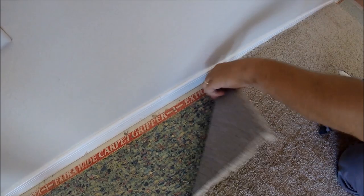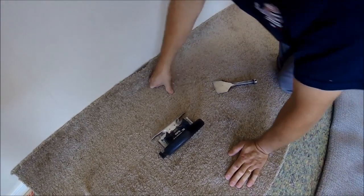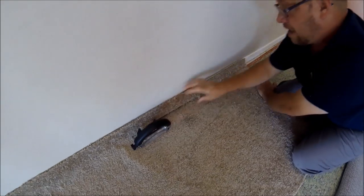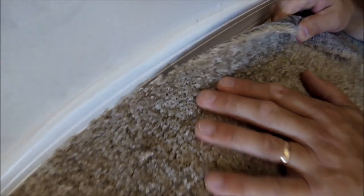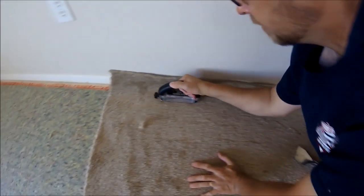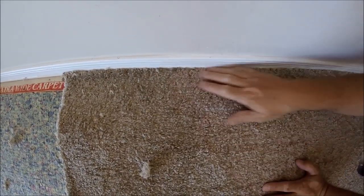So I'm going to pull this up now and lean it the other way. I'm going to cut this without mashing it in the corner, just to show you that it will cut short. I didn't mash it in there or anything — see that? It's just flush. That's not even good enough to pack right there. It's just touching the wall. It's just falling flush with the wall — that's not going to work because you need a little something. You need just a little something to put pressure on it whenever it packs in there — it's going to mash back on the tack strip. I'm going to finish this wall without pushing it in. It's flush all the way down through there. That is not packable. That will pull off if you try to stretch away from that.